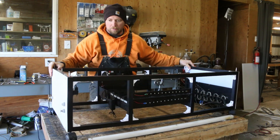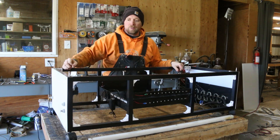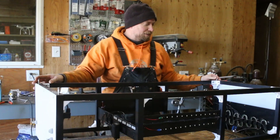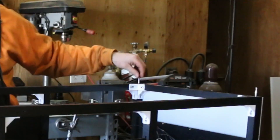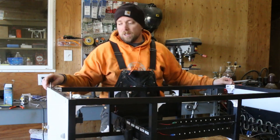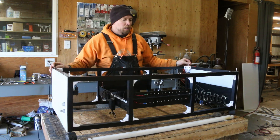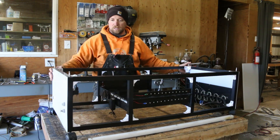We're dealing with that problem on the 3D printer right now. We're going to be removing these support members completely — the idea was the same as stainless steel where you'd just set them in, they connect, and you move on. The ones I really wanted were expensive and we need a lot of them, and everything that costs a lot has to be questioned because we need to reduce costs. I got these as a substitute and they work fine, but you really have to be perfect in your hole drilling — otherwise you create a bigger hole, that leads to slop, which ruins the rigidity they're supposed to provide. So they're going to go. We'll add more bracing to the inside and add custom brackets in all four corners.